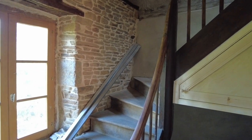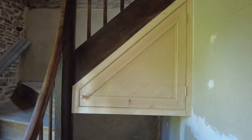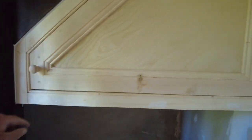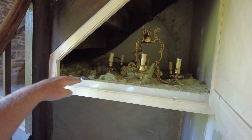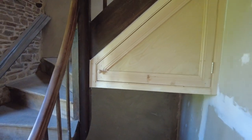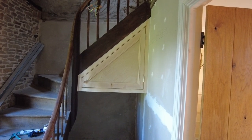As I said earlier, I'll be gluing and pegging this together and put it up this evening - and it is this evening now, I've done it. There you go, that's the spandrel on the staircase. I'll show you the little handle here, and you can see the little square pegs to pull all the tenons in at all the corners. It just functions on a little magnet that catches it here. We're going to deck this out tomorrow, clear all this up, and paint the inside white. That's it - one spandrel done. Having a good week with plenty of joinery; onto the next joinery job, each one is nearer to the end.